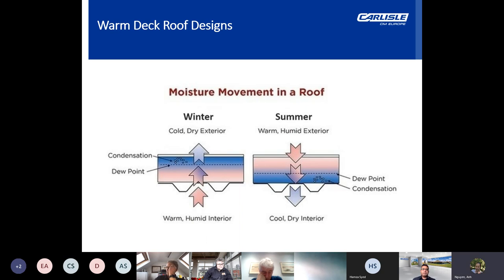Now, next we'll look at various types of roof build-ups and where the vapor control layer fits within this. Now, firstly is the warm deck roof. The warm deck roof design is a modern method for flat roof construction and is preferred wherever this option is possible. Now, this provides a more reliable roof as the insulating layer is located above the roof rafters and between the structural supports, which results in a temperature for the roof and loft area that is consistent with the rest of the property.